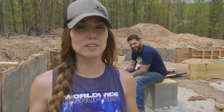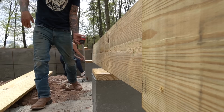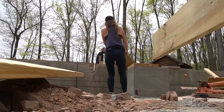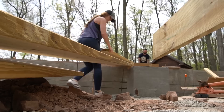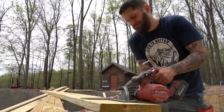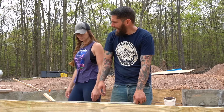We are now four 2x12s wide down at the safe room end of the house. Everything is lagged together, and now we're going to start constructing the beam down towards the powerhouse end of the house. We actually decided to pull the form out — it wasn't in place yet so it was easy to do. We pulled it out and now we can run the beam all the way down 4 inches into the footer wall and pour the concrete around it. We cut this at 7'3½" and then cut back at 15'5", put it on, and rock and roll the entire way down — and we're done.